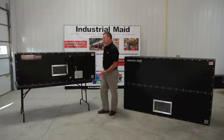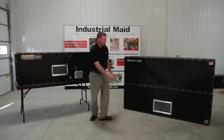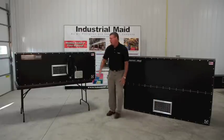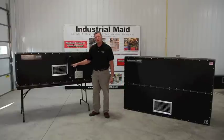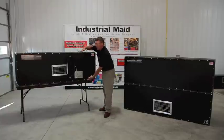Now these units are T-style units. The air comes in both ends and exhausts out. Also on this system we've got an outlet grill here. This unit here is a T3000 — it's a three-quarter horsepower, 3000 CFM unit. You can see it's one single modular cabinet.